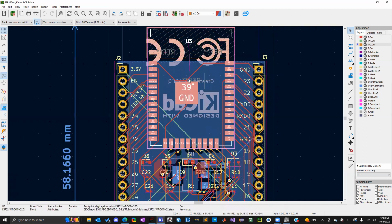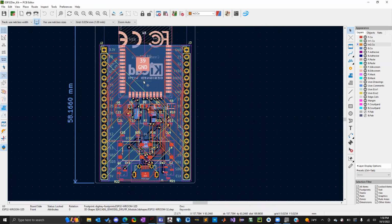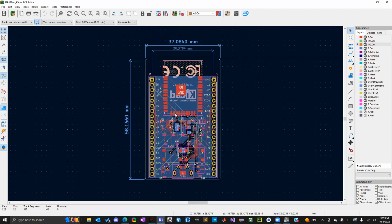The only extra thing is the ESP32 is capable of Bluetooth communication and also Wi-Fi communication. But if that's not what you guys want, if you're not going to use Bluetooth, you're not going to use Wi-Fi, then I highly recommend creating the STM32 developer kit. If you're interested in that, then just let me know and I'll throw up a design because these are pretty easy. I'm used to the habit of creating these, so I can go through them really quickly. So the STM32 can't do Wi-Fi or Bluetooth, but it has a lot more processing power because it has more room in the chip to allow for that. But that's basically all for this session.